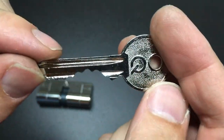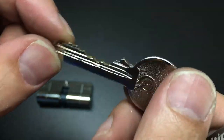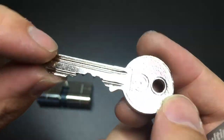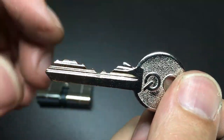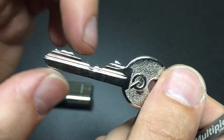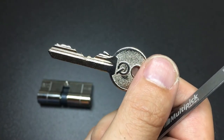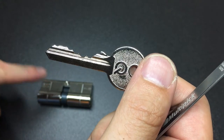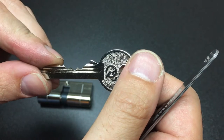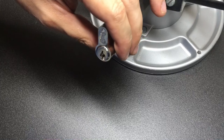I think it's made particularly tricky by this bitting. I've heard rumours that the other one-star cylinders are also tricky and have good bittings too — I haven't had experience with that, but if they're anything like this then that's pretty good going by Green Tech. I'm going to grab a vice, throw it in, and have a go at picking this lock, then gut it properly.